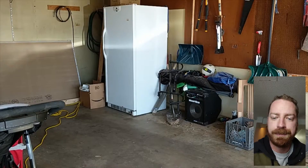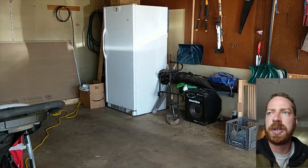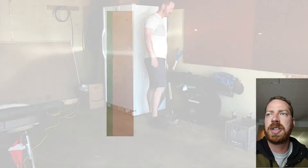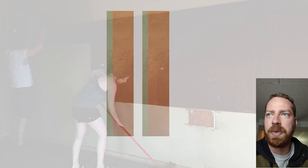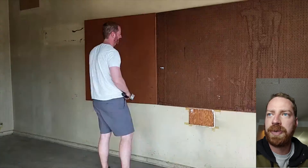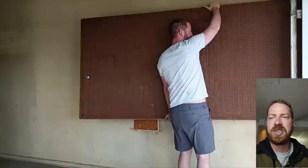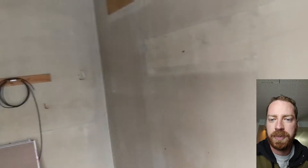What we're going to do is — we have the existing wood frame with no insulation on that middle portion of the wall, but there's a normal set of drywall. We're going to put in a one-inch air gap, install more framing with insulation, and then use 5/8-inch thick drywall on the outside of that. As you can see here, this is what it looks like once we've got everything cleaned out.